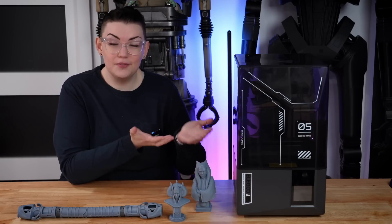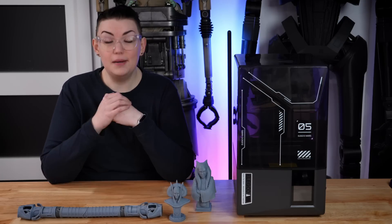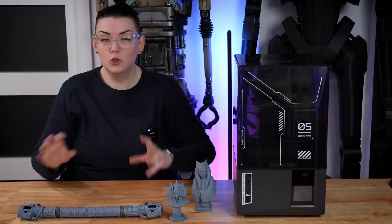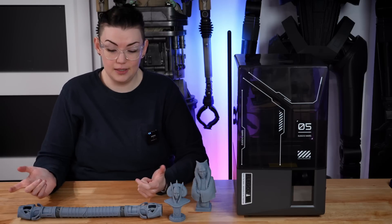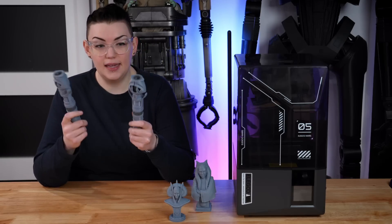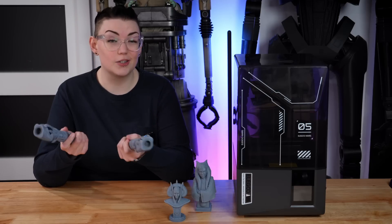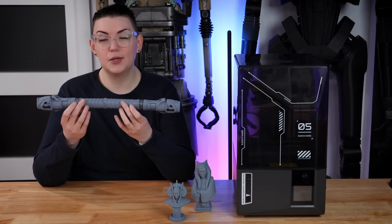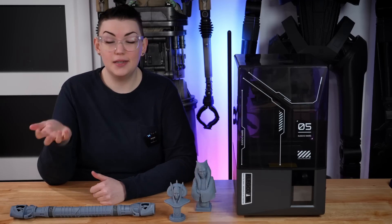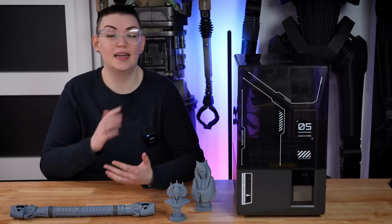Of course, when the literal vat of the printer is moving up and down, there's obviously sloshing of the resin going on. But maybe because it's such an even and consistent movement, there was not a single blooming or blooming-like effect on any of these prints. I very specifically wanted to try printing a lightsaber because lightsabers — with their larger chunkier pieces — can very easily develop blooming. But the fact that there wasn't blooming on any of these pieces despite the resin continuously sloshing around, I would say that blooming is not an issue with the movement functions this machine has.